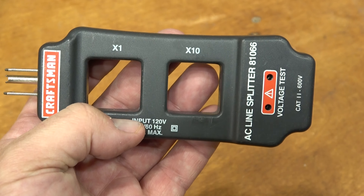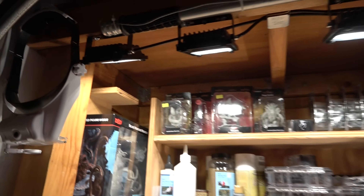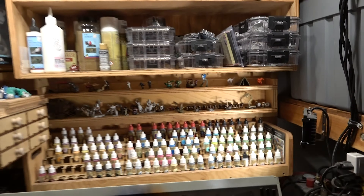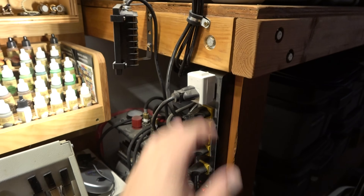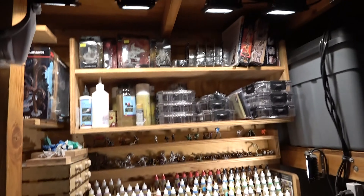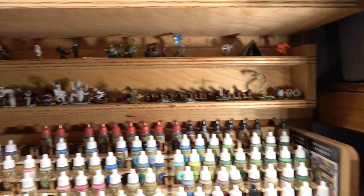I've got a line splitter so I can check the amp draw. One light plugged in is pulling 0.3 amps, and four of them together pull 1.1 amps. Check the labels on your equipment to make sure your combined amperage isn't exceeding 1800 watts or 15 amps. I'm using the 15 watt model — four 15 watt lights plus a fifth 15 watt over here lighting up my paint station. I've got a paint booth with a fan on a switch that blows air out through ducts on the side of the house. A side light gives some underlight to fill shadows cast from the downward-facing ones.